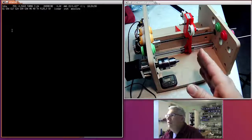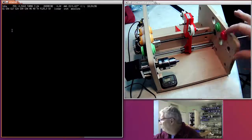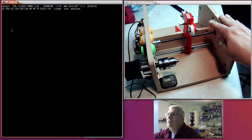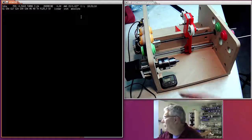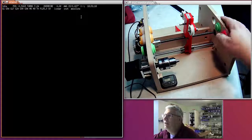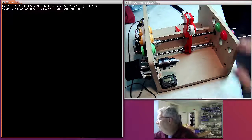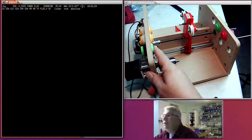It is moving. If you want to change the X-axis direction while in this mode, you can use the hold button. You can see on the screen there are two arrows showing which direction the X-axis will go when jogging with the green button. Hitting hold toggles the direction — now it's going to go to the left. Then I put it back in idle mode and run it again, and now it goes back the other way.